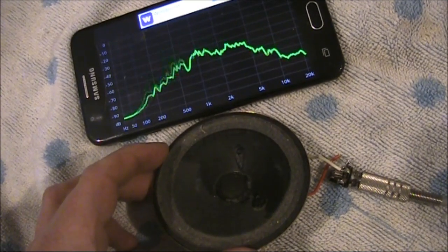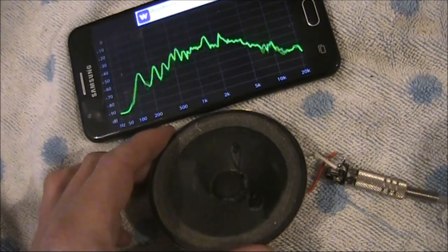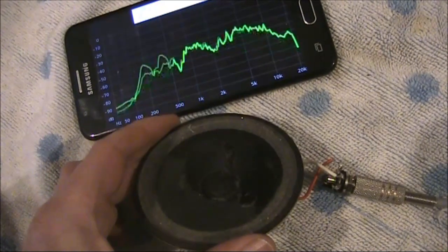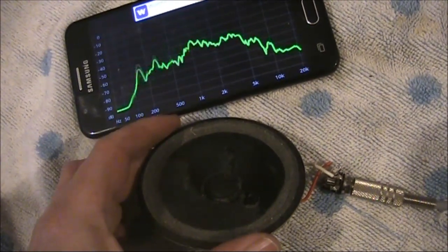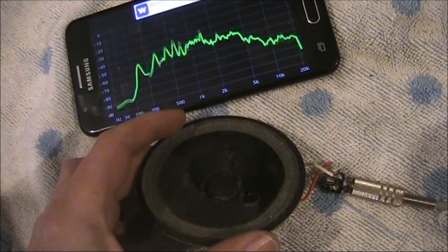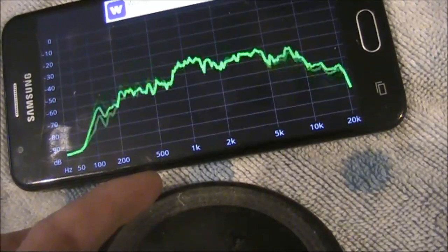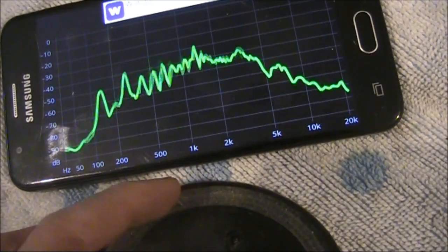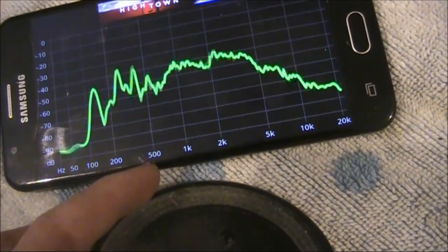A quick way of improving CW reception. All you need is a speaker on a piece of wire and two hands. Just for this test, I've got white noise coming in from a receiver set to FM. As you can see, the response is fairly smooth over a wide range. That's not ideal for selective CW reception.